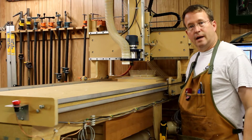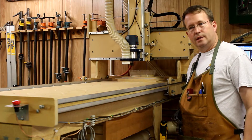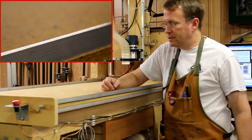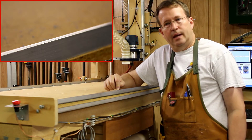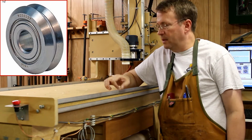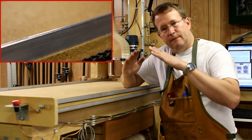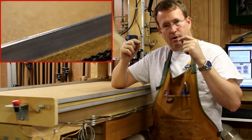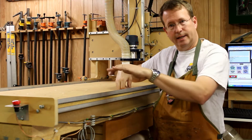This project has been a long time coming. I built this CNC machine back around 2008, using aluminum 3/4-inch angle to provide a rail. The ball bearings that ride on it have a 90-degree groove that fits on the angle, but over time the surface area pushes down on the aluminum and eventually creates flat spots. On each end the flats are very small, but in the center they're quite wide, so I need to create a consistent angle along the entire length.